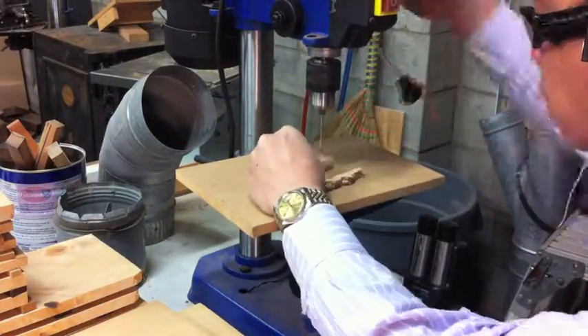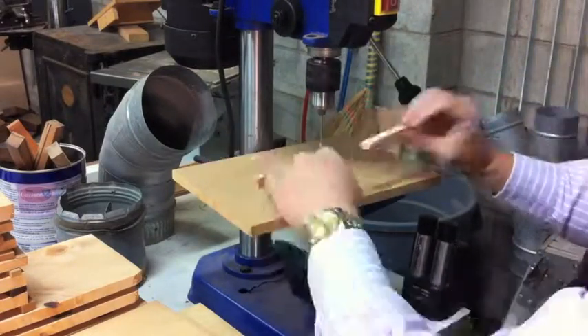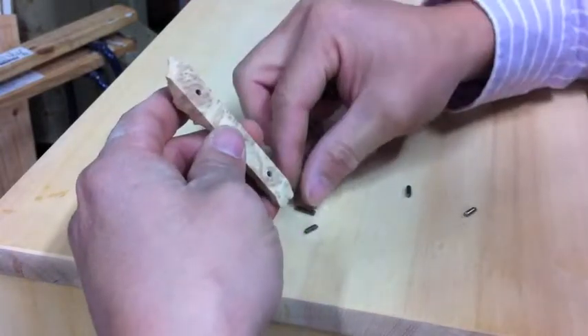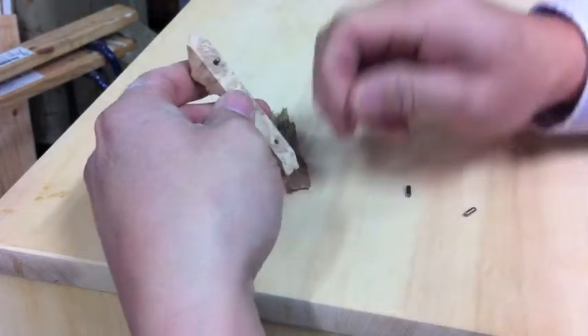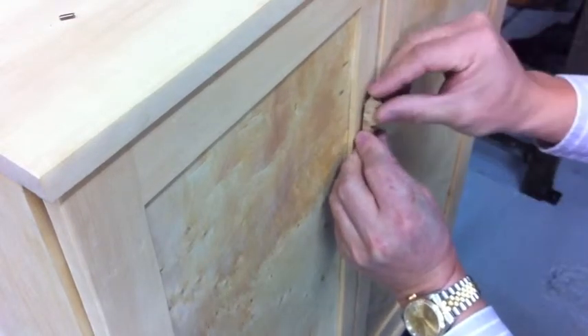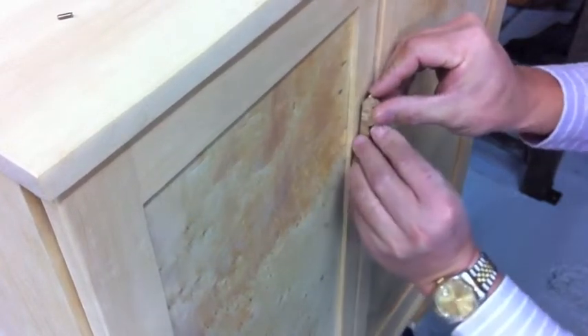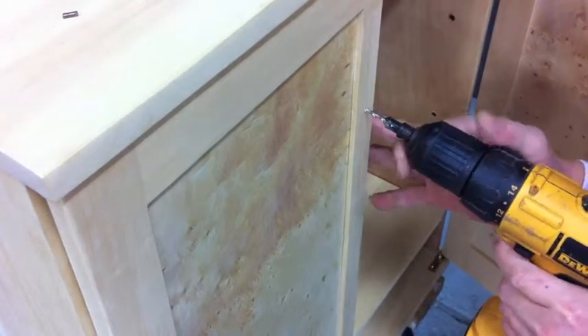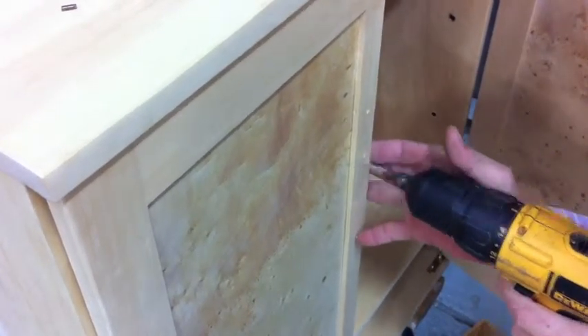Next I put two holes on the back of the door pulls so we can put the screws in. I could have glued the door pulls in place but I prefer to use screws — that way we can take the handles off and reverse them when moving. I transfer where the two holes are meant to go using two little pins — actually two-and-a-half mil welding rods cut to length, basically like a dowel locator. Once I'm happy with the position I press the pull in place and that leaves two marks on the door. I then use a cordless drill to drill the two-and-a-half mil holes where the screws will go, and counter-sink the other side.